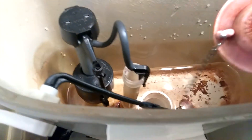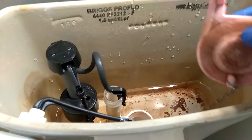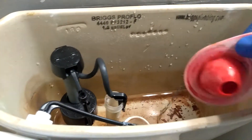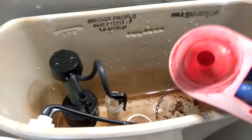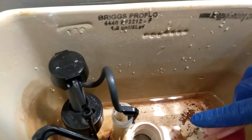Now this is the flapper in my hand. As you can see, you see how dirt builds up — that's basically on the top of the flapper. You see the round area where you have a little dirt, and that can prevent the flapper from having a good seal with the top of the draining water hole.